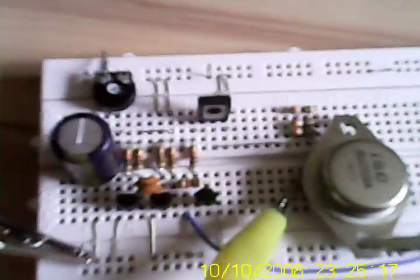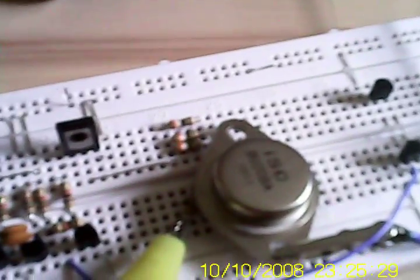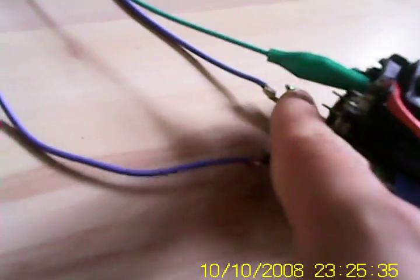It's self-oscillating, so let's see some sparks at 12 volt input voltage. With more voltage the sparks will get longer, of course. I'm not sure how much voltage this transistor can handle as input, because from collector to plus you don't have 12 volts — you've got pulses that are probably far over 100 volts. I've touched it accidentally before with my finger and it wasn't pleasant.